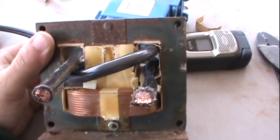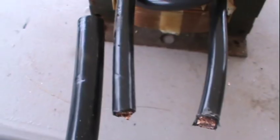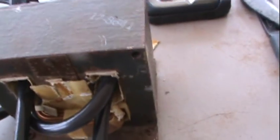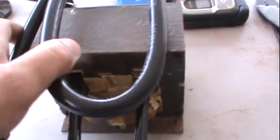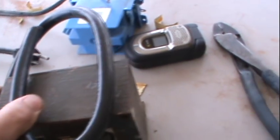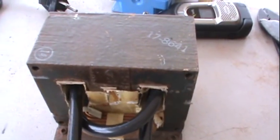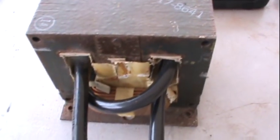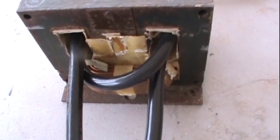Primary at the bottom, the secondary at the top. The aught gauge wire, as you can see, is a lot bigger. I'm going to try one of these, but what that's going to entail is cutting the top off and then winding this wire over it. It would be impossible to shape this wire to fold through there twice with it closed like this — or maybe not impossible, but you would have to have pipe benders or some way to form the wire that I just don't have right now.